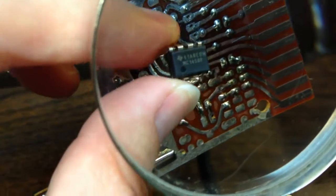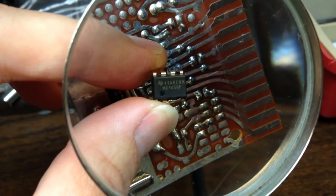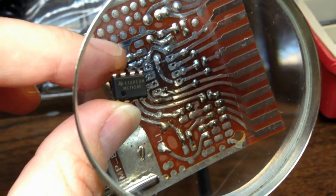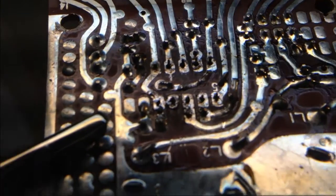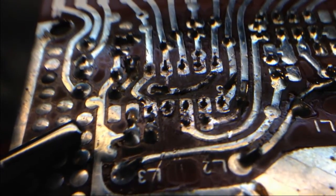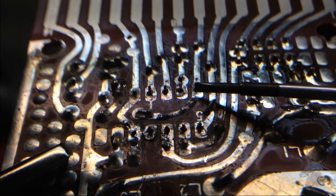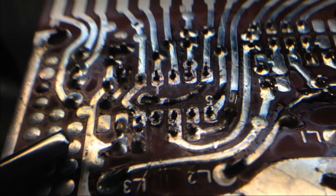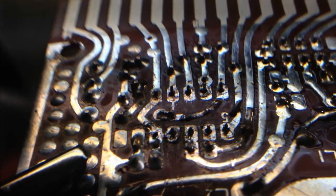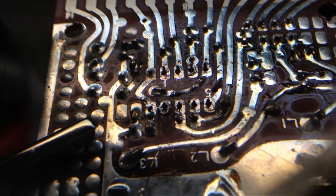Here's the replacement part. Let's get it on the magnifying glass so we can see better - that's a direct replacement. Let's get it on this board and see if we can bring this thing back to life. We have the new chip in there. The first thing we're going to do is bend over a couple of these legs - take one and bend it over, and another one on the other side - so that the chip tends to stay in while we're soldering it back in. That's actually the way it was from the factory as well.